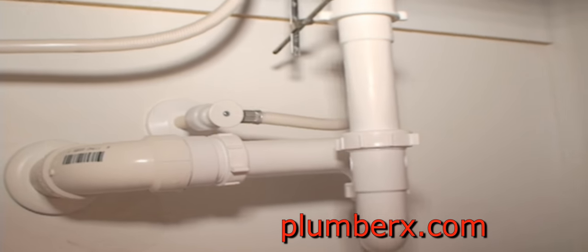So what I did here is I grabbed a small plastic container, and this is the place that I like to start first, even after plunging, because I know the issue is most likely right here. And you can see right there all the hair that's down in there. Okay, there's even more hair than that down in there, but you can see the issue. And you notice I pulled the pop-up plug, the lever, out. That way I can have a straight shot from up top down to the bottom up under the sink.